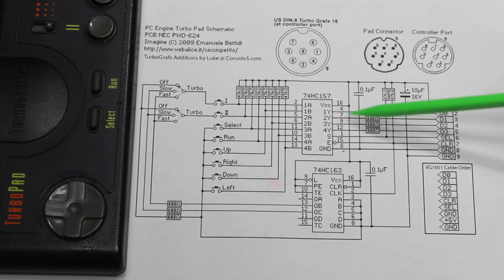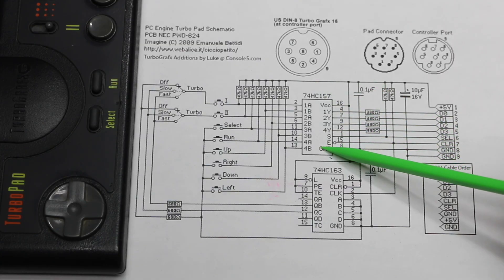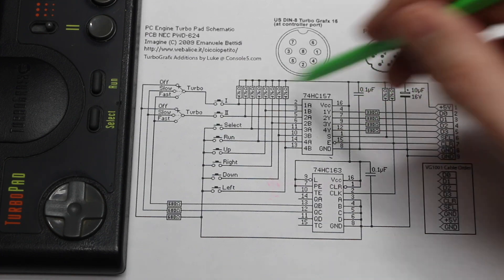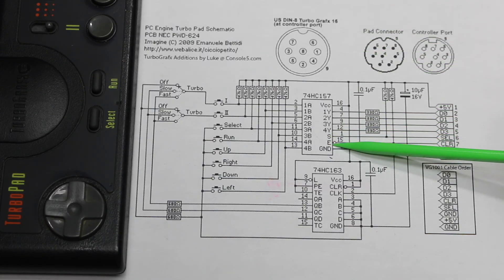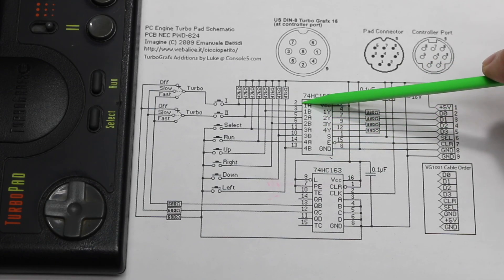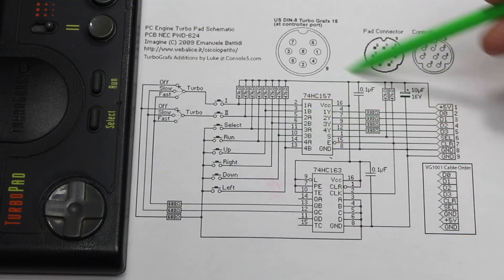To get a circuit to replicate this, I tried using an ESP32 to quickly handle all of it, but it wasn't working. By the time I could read switches, set data outputs, and respond to interrupts on these control signals, there would still be delayed behavior. The enable goes high and low in a very short time — the real hardware sets those four outputs momentarily low and then high again, responding in real time. Meanwhile the ESP32 is still getting around to responding. This enable pulse can be within five or even two and a half microseconds of duration, and the chip responds immediately. So I'll ultimately be using this same 74HC157 in my circuit and just hook up the ESP32 to control buttons over Bluetooth, letting the real hardware handle the timing.